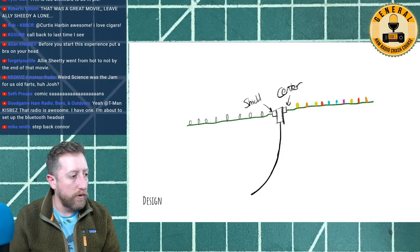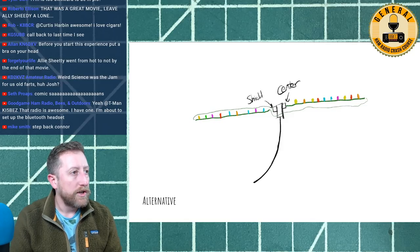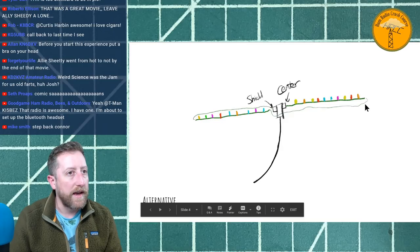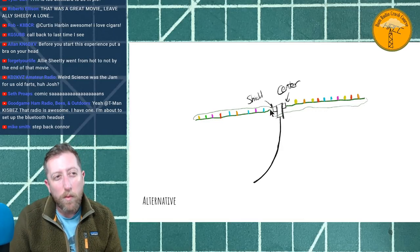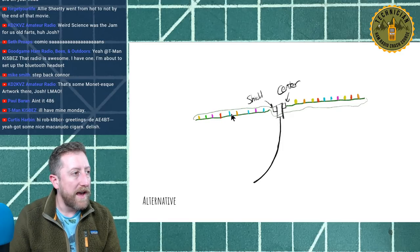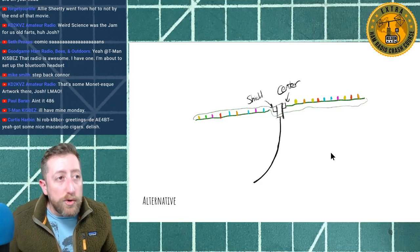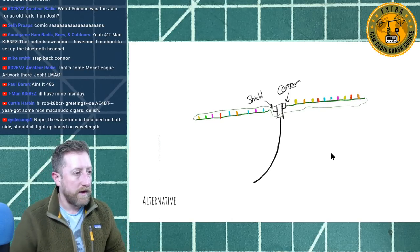That's the way forward. Now, there is an alternative, and that's if you ran basically a wire off the end of this guy down around to basically where the other leg would connect to the balun, connecting it at that point, circling that around, and then connecting it to the shield side. It's a bit funky. That's not necessarily what I wanted to do, but that's okay because we've got a plan and we've got a way to move forward. All right.